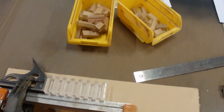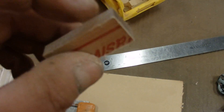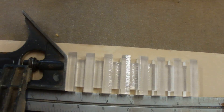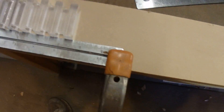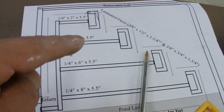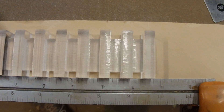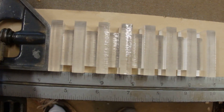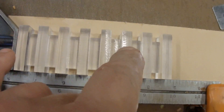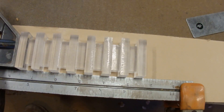I feel like I'm making some progress now. I've got my parts cut up. Before I get to this point I have to peel the paper off, then I pick the best face, polish it, and leave the saw marks in — I like that look, it's really cool. The back is going to get sanded all at once once it's glued together to make it perfectly flat so it'll glue up to the ledge. The tops and bottoms have already been dressed, so we're just about ready for glue-up. The next level down will be alternated — it'll start with the small pieces on the outside and big pieces on the inside. That's the way he wants it.